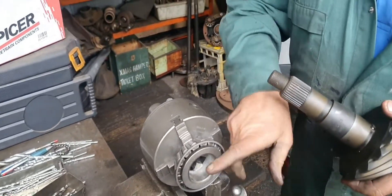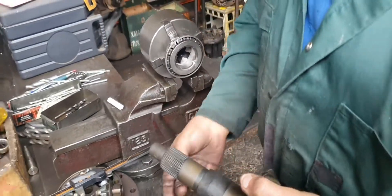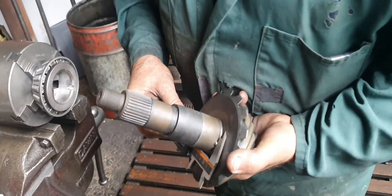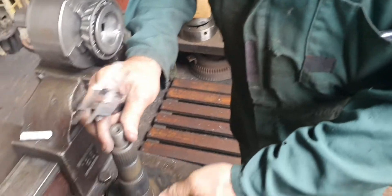This is the M86. I measured the interference fit on that ball — half a thou. Probably the bonderizing might even take up that. But the only way you can fix this is drill a hole with a masonry drill and put a quarter ball bearing in there.